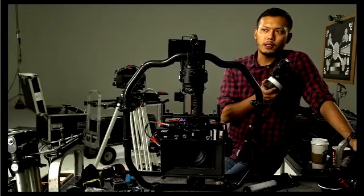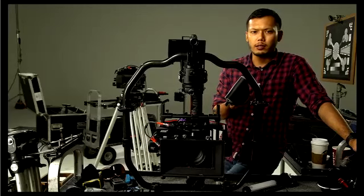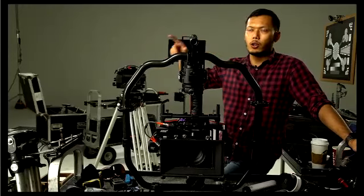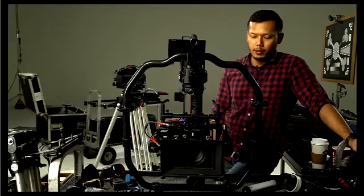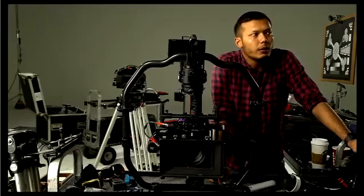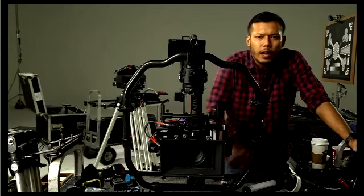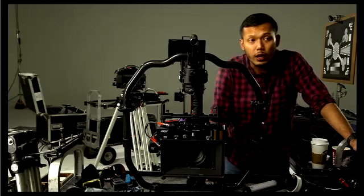To change the RF signal, there's channel 1 to 7 in the hand unit, and there's 1 to 14 inside the camera itself, because I think the other 7 of the RF bandwidth inside the camera is reserved for additional hand units, or maybe something else that controls the camera, because I've never used anything other than a second hand unit. But if you're talking about Wi-Fi, unless you're using 2.4 gigahertz RF signals, there shouldn't be much of a problem, as long as you find the right channel, the right bandwidth for your connection, which is why you have to test it on the day.